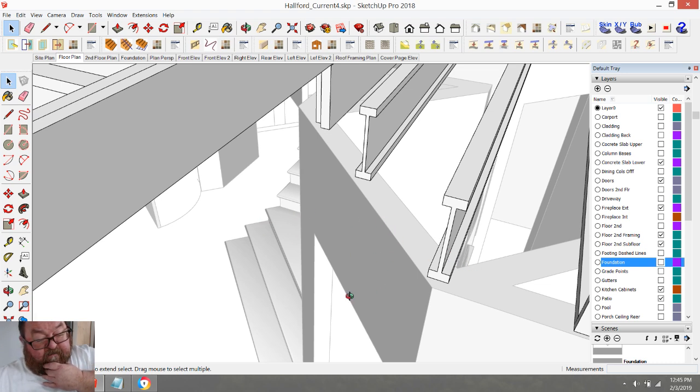So I think there would be less cutting if we just continued them going this way. Well, if they came this way, no, they would just be cut. Yeah, there would be less cutting if they continued in this direction, wouldn't there? Because those could all sit on that ledge that's left over. You only need like 2.5 inches or 2 inches of bearing. There's plenty of bearing there.